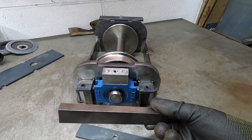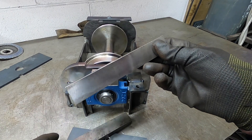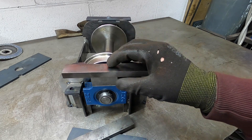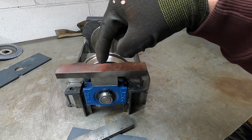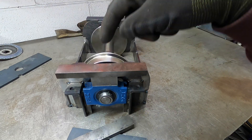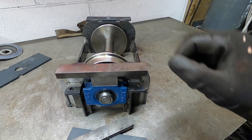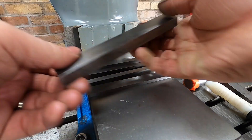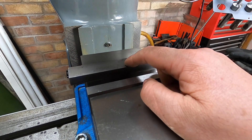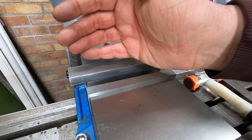I have this pair of proper one-inch imperial half-inch bright bar. I've just given it a wire wheel because it got a bit of surface rust on it, but that's going to go across there. We need to put a hole here to bolt into the top block, and then our two holes here - as this is bright bar, these are going to be threaded, and these pieces that come down here are going to be locked in. We put the parallels in, we're going to machine it down to length, then find the center and put an 8mm hole there for the 8mm bolt on the riser block on the axle. Then we'll put the two end ones in, which are slightly off center.